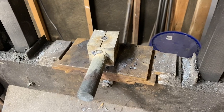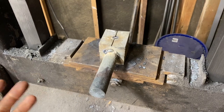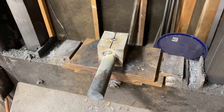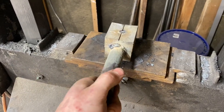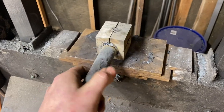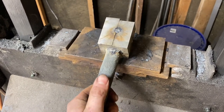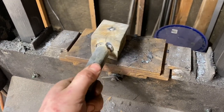Squaring dies would be good for this but I don't have any and don't really feel like stopping to make them. People use them for canister too, but I've pulled off canister plenty of times without them. My plan is to press, turn, press, turn all the way around. This billet's nice and fat so it should hold welding heat a good long while. I'm not too worried about it — let's get it on the forge and see what happens.